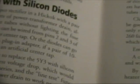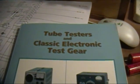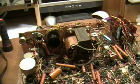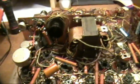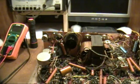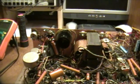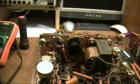There's a good article on Tube Sound about it, and in this book, the book on tube testers and classic electronic test gear. What that does is replace the 83 tube, and I actually like it better in these B&K testers. I've heard it sometimes doesn't work in the Hickok testers, although I don't have as much experience with those. But I've always been able to make it work in the B&K circuit. It cuts down on the power consumption, and of course preserves your 83 tubes for use in circuits that are more critical, as I understand the Hickok is.